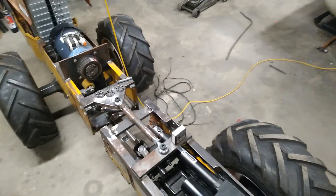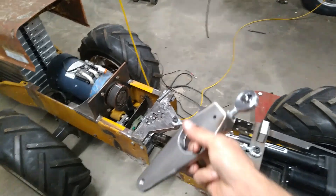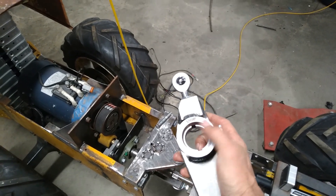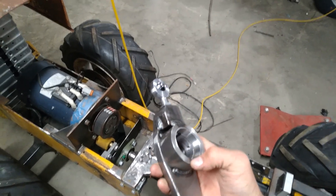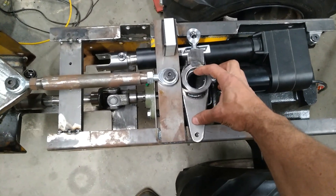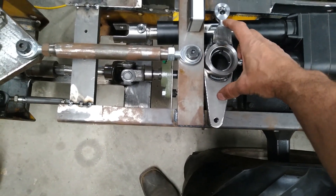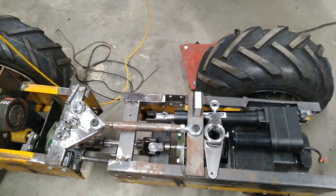What I'm gonna do is get that actuator out of there. This is my little cross link that goes underneath — that's what turns it, and that's where my taper bearings are. So what I'm going to do: this is a two-and-a-half inch OD right there, and I'm going to get a thin sprocket — probably like a 40-tooth or so — where the center line to the outer edge is short enough that it won't interfere with my little cross link or push rod.